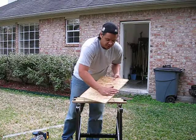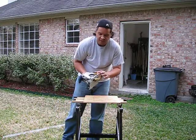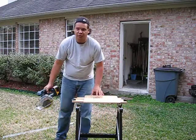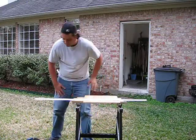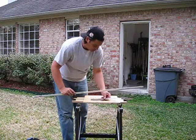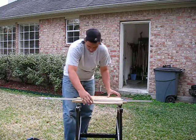One of the things I found out about my circular saw is that the distance from the blade to the edge of the guide here is one inch. So for me to actually put that guide bar on there, all I need to do is make sure it's about an inch away from where I want to cut and everything's good. Just hold on while I set that up one more time and make the other cuts.